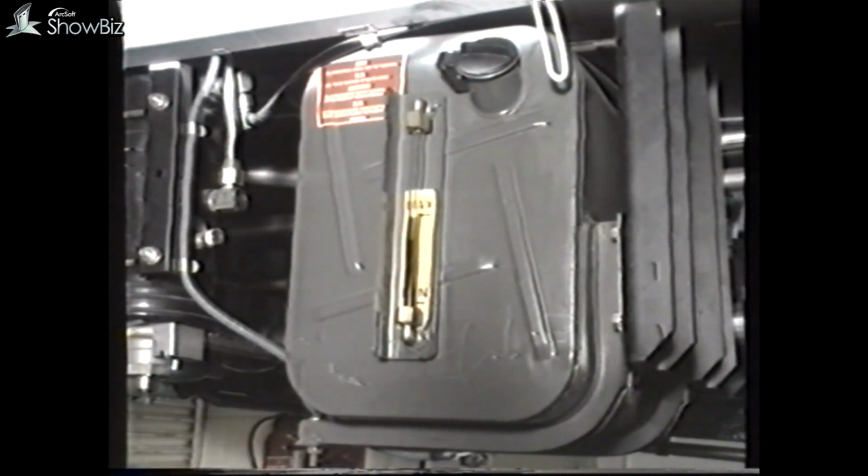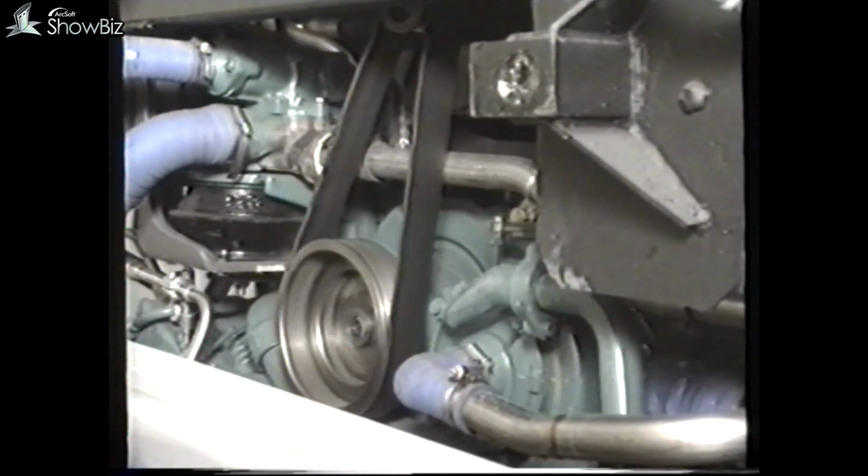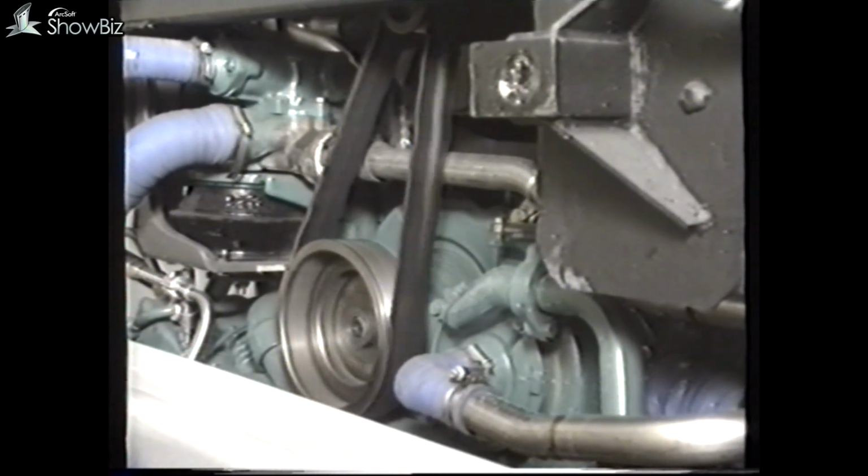When refilling the engine, add oil to the external tank until the level indicator on the sight glass is between the minimum and maximum mark. Start the engine and allow to idle. During this period, always ensure that the oil pressure light goes out without any undue delay. And finally, check the oil level in the oil tank with the engine still running and top up as required.